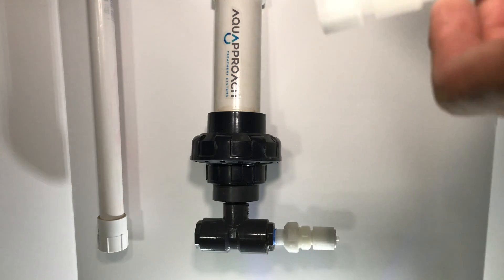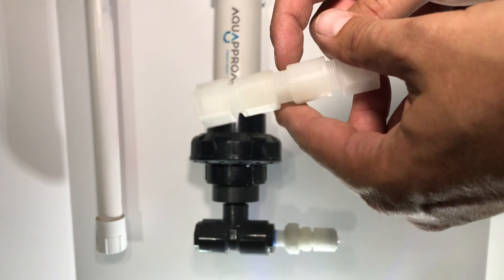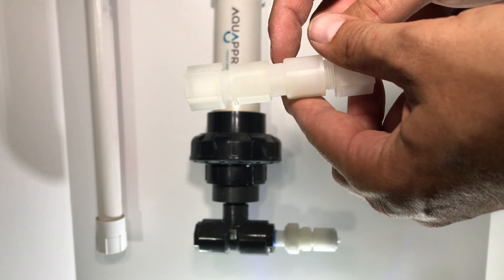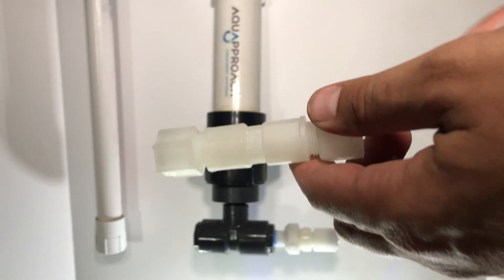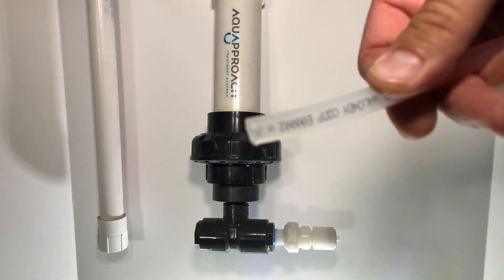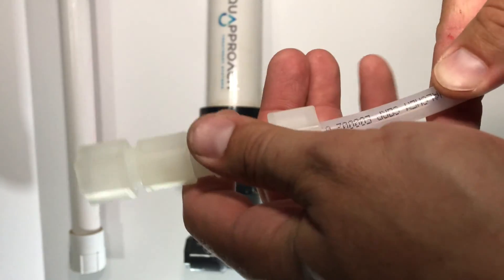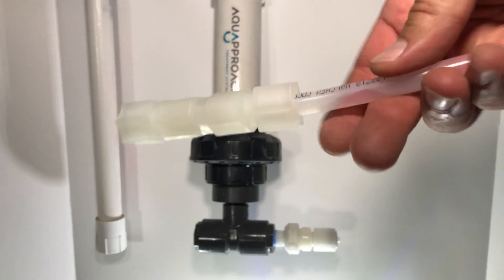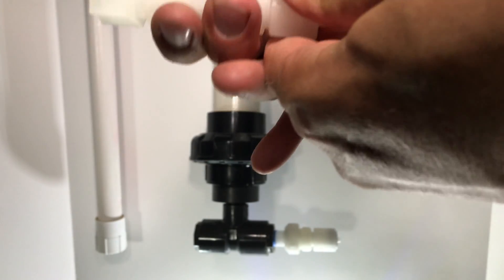Next, let's take a look at your safety check valve, which will come in the kit. In the middle of the safety check valve is a directional arrow. Make sure the arrow is pointed in the right direction. The safety check should be placed in line between the pump and the injection valve. Slide the compression fitting onto the end of the tubing. The tubing will go into the fitting about an inch and a quarter. Tighten this up by hand and then finish with one turn with pliers.